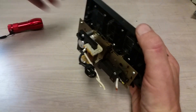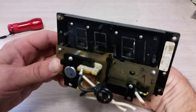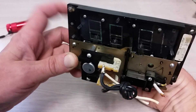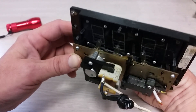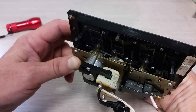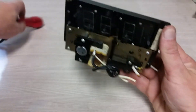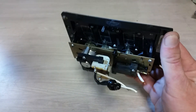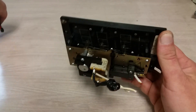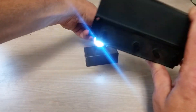It works by moving shutters. You can see how that bit is moving back and forth. The minutes segment is not working as well — it's all seized up. But if you look down in there, you can see a little cam that moves that back and forth, and underneath all this is a little shutter. It moves a little shutter around, blocking off certain segments. There's no electronics involved — just cams and levers.